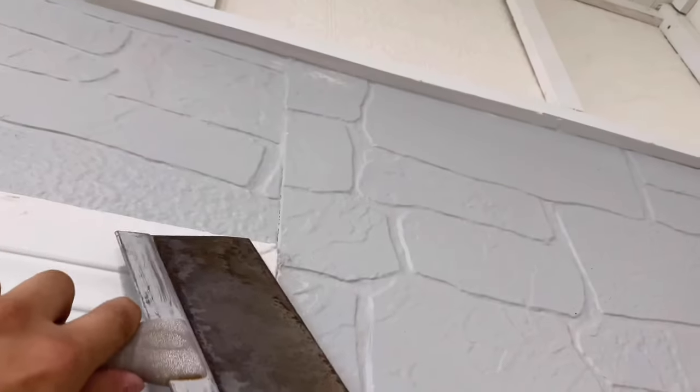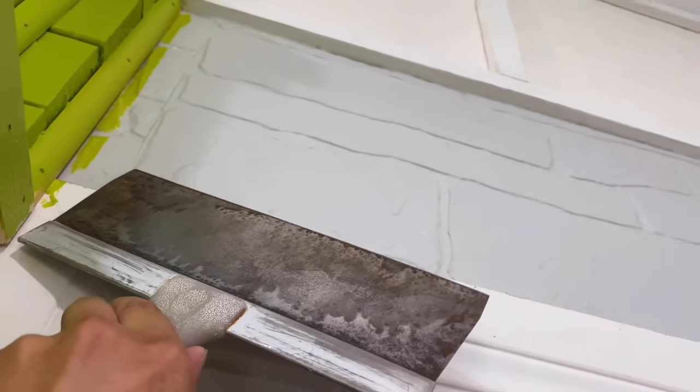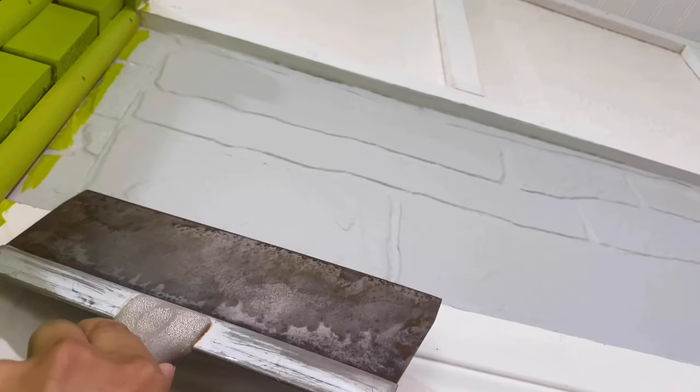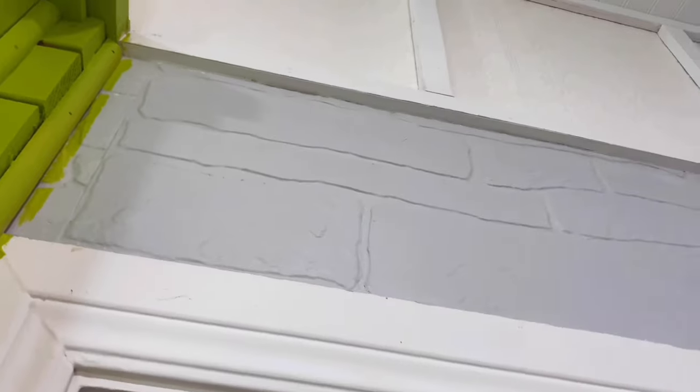Anything that's an indention is fine because we're going to fill those low spots in. Right here, it's going to need mud and tape on this seam where the two wall panels meet together. There's one right here too — another line that's going to need mud and tape. And unfortunately it's right next to that, but it'll still show. Another example: this closet is actually what the rest of the house looked like. I primed it and then did exactly what I'm about to do on this wall.